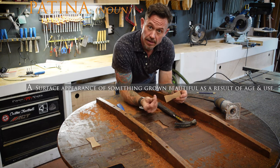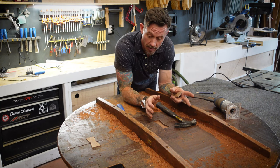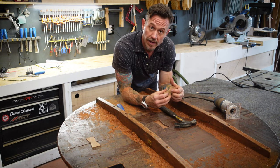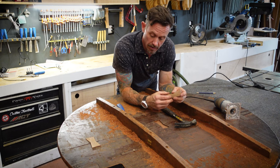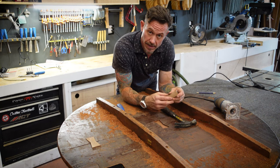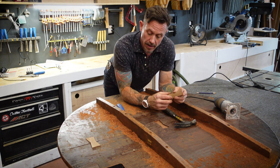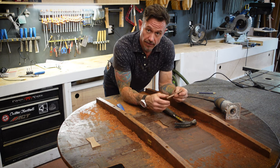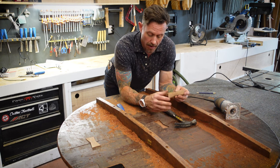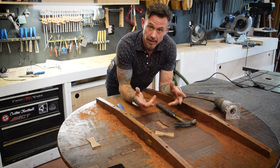This particular table had a nice patina to it, but it also had an issue with sun bleaching — somebody kept a centerpiece on this table for a while, while the rest of the table got exposed to sun and created a nice bleaching effect, which you get with mahogany, especially antiques. You'll get that really nice golden patina that accumulates on the surface. But unfortunately, with this split through the top and the discoloration from the centerpiece, it might be a good idea to resurface the top a bit and then do a French polish on it. So I'm going to clean all this debris out, glue these butterfly keys into place, flip the tabletop over, and assess that.